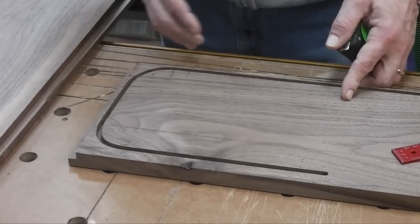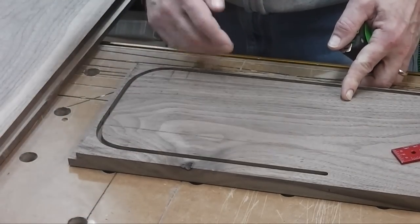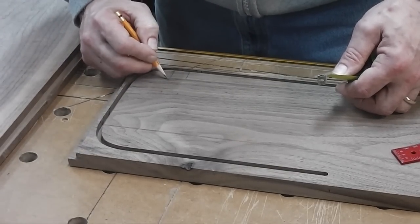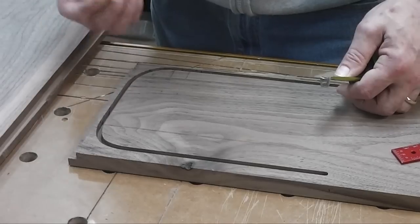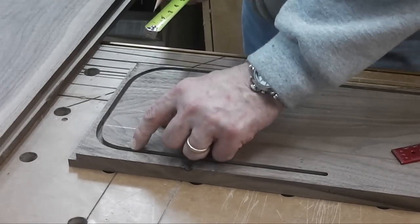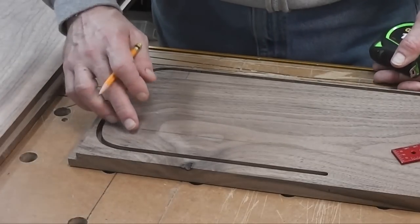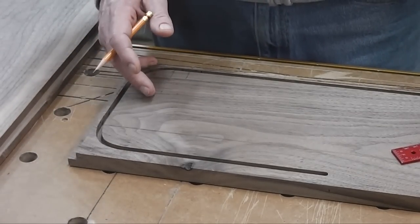This is what I've done so far. I've gone in 2 inches from this end, which is going to be enough to clear when the sides go in — that's enough for the tambour to clear that. So I went 2 inches in, then I want an eighth of an inch off of each end. From there I want three-quarters of an inch and I want to give myself some extra clearance for knobs that are going in the drawers. Most of the small ones won't be larger than that. Then I've got three-quarters of an inch, then three-eighths of an inch off the back for an eighth-inch spacing, then a quarter inch back. If I measure between those two spots, I've got 5½ inches. So I need to make the width of the sides going inside the hutch 5½ inches wide and they're going to be 8½ inches tall.